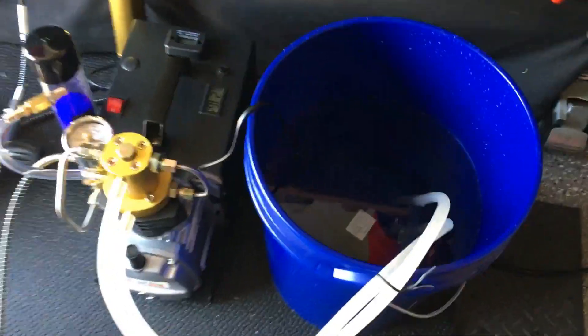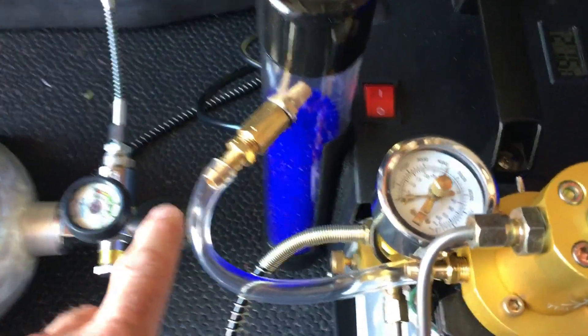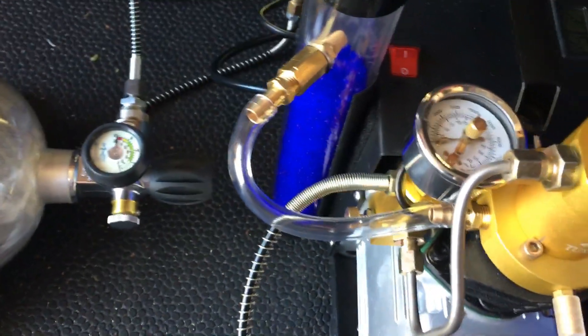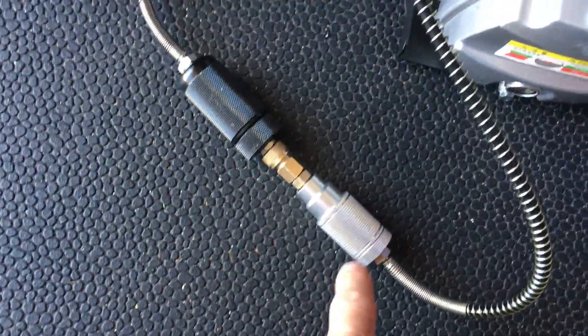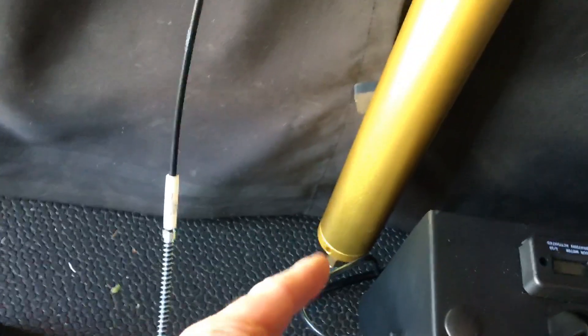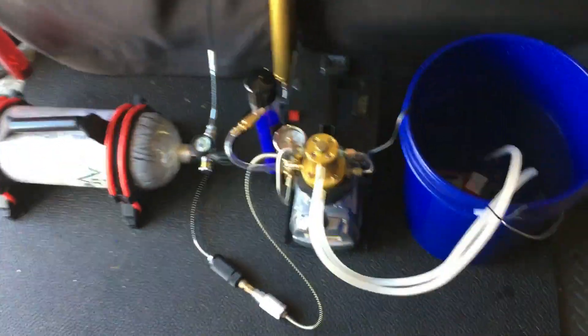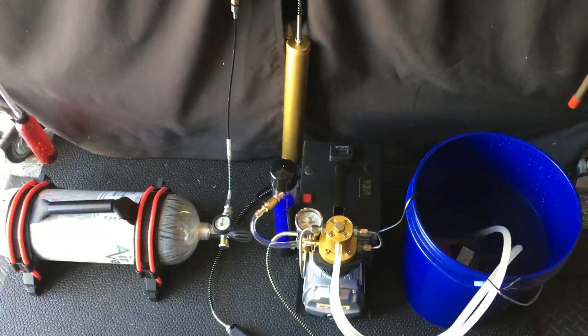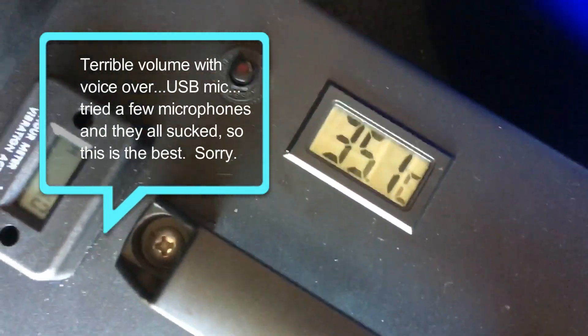Sorry for the shakiness but we're off tripod now. As you can see, this is how things are set up and connected: going from air intake through the desiccant air intake, into the tank we have water flowing, and we're down to 21 and a half degrees Celsius. I've got a vibration meter on there, and the output is going through stage one, stage two, and then up through stage three - a vertical filter so that moisture and oil get trapped at the bottom.